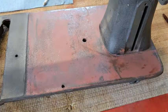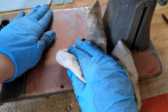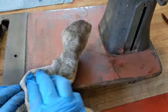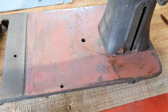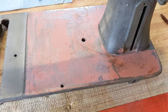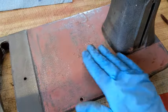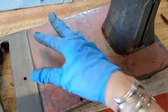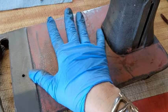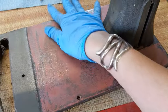I hope that's not oil — if it is, I'll clean it off. This part was machine finished really well, but over here it was very, very Swiss cheesy. Every company seemed to have its own concoction of how they did Japanning — the black coat. It's like an asphalt linseed oil kind of weird mix. It was really, really thick, and a lot of times if they had a rough base, that Japanning would fill it in. It would act like a filler and a coating.